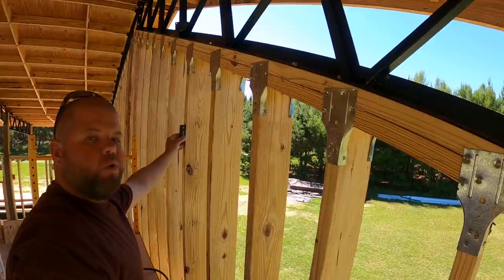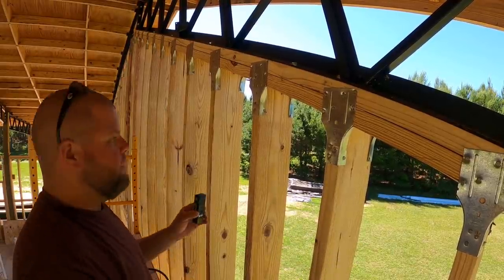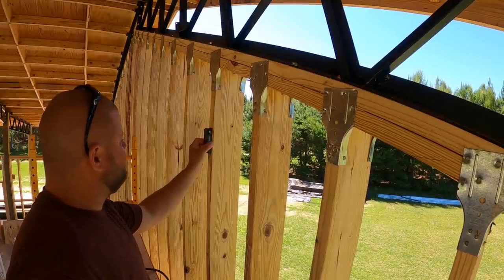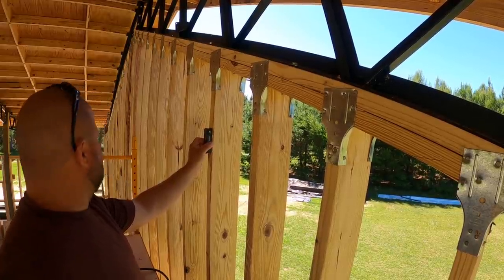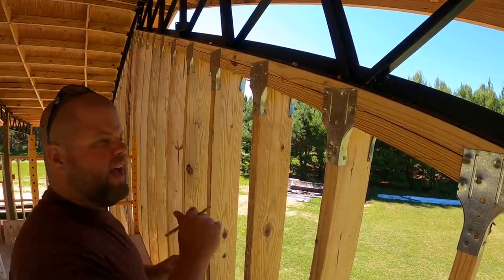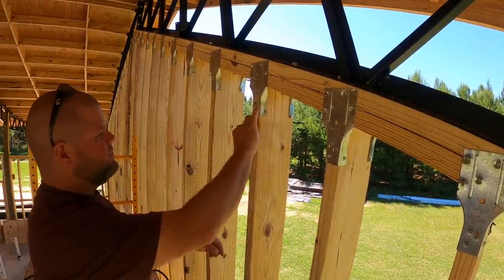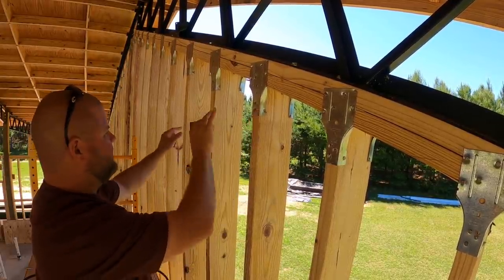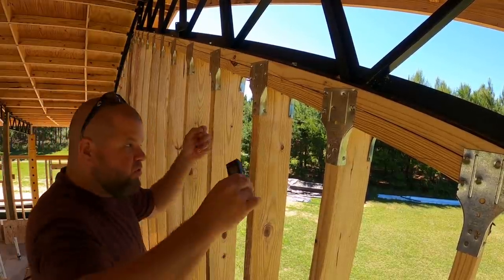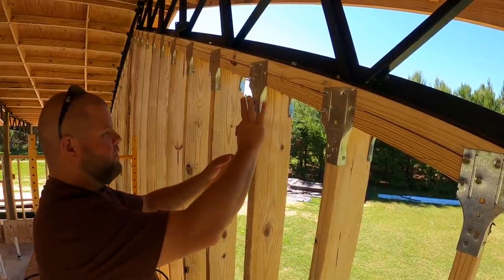Well, 12 foot and 1/16 of an inch to that line, it says exactly what that post was down there. 12 foot 1/16. So as of right now, at least down to the concrete, the line is exactly where we need it. I'm almost thinking we're going to double check this, that I can use this to quickly put inside the studs and figure my blocking out. This would be so much quicker and less trouble than trying to hold a tape measure. So let's see here. We got our line perfectly where we want.